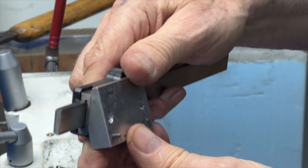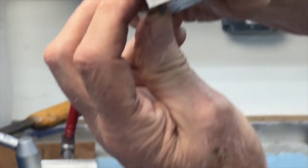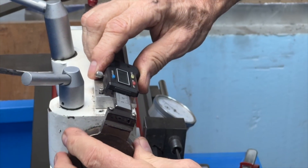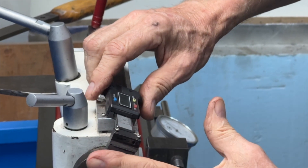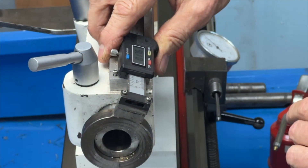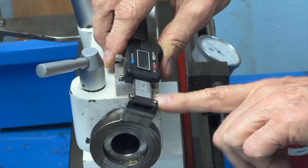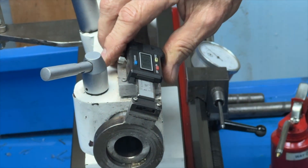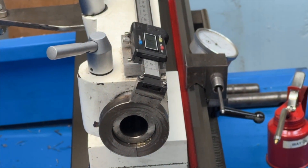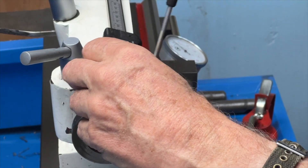There's the readout — it's just an aluminum block screwed in from the bottom. It has the proper angle on it so that this lines up flat; it can't be twisted or anything. What I do is make the block first, then make this piece, put it on there, and draw a line on it so I know it's exactly in the right place, and then make the top piece. You can see my shim fell out because I made it just a hair too short.